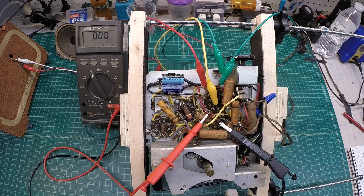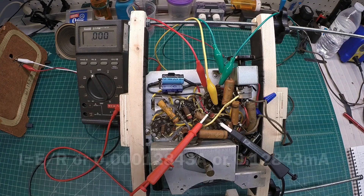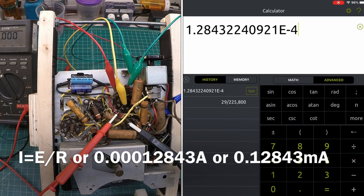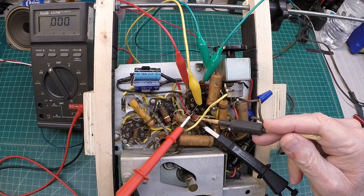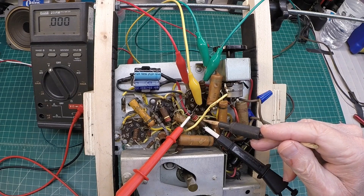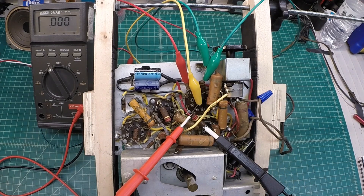The current consumption spec for this tube, based on the radio's original measurements, is 0.2 milliamps. Taking the voltage divided by resistance to calculate current in amps and converting to milliamps, we're only showing about 0.1284 milliamps. So being that the plate load resistor was in tolerance and up to spec, in addition to the low current consumption of the 12SQ7, that resulted in the B+ voltage being spot-on and not impacted.